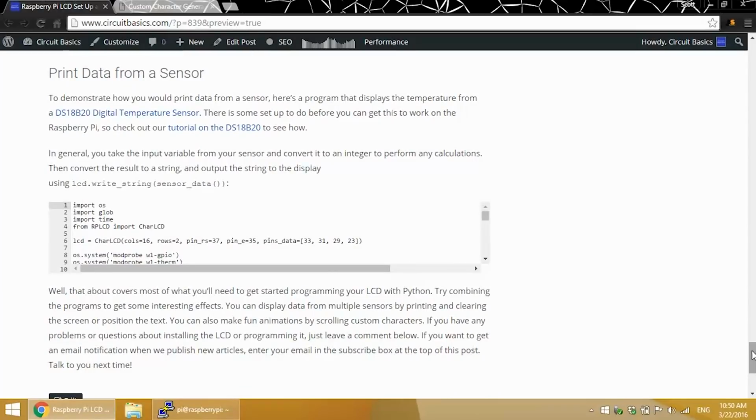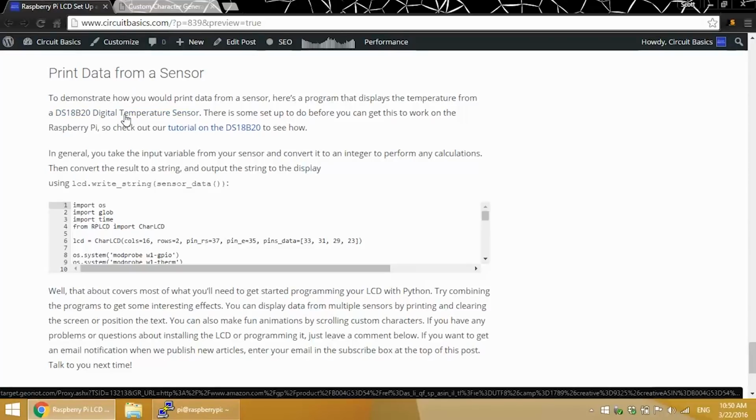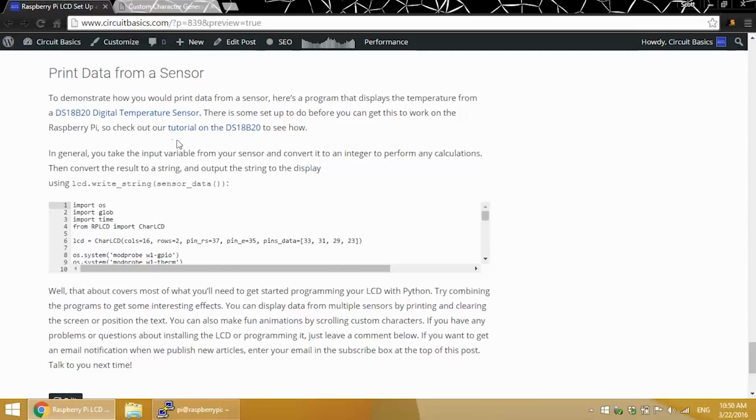Alright, now let's see how to print data from a sensor to the LCD. I'll be using the DS18B20 digital temperature sensor here, but this will work with any sensor. All you need to do is put the variable for your sensor reading in the LCD write string function. If you want to try this with the DS18B20, there is some setup to do before it'll work on the Pi, so check out our tutorial on that to see how. I'll leave a link to that post in the description instead of going over everything in this video.